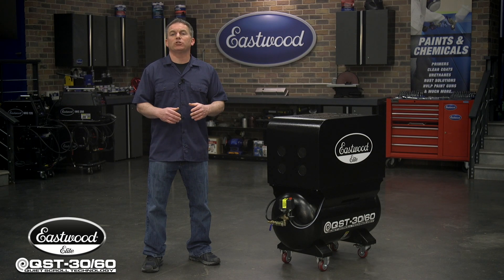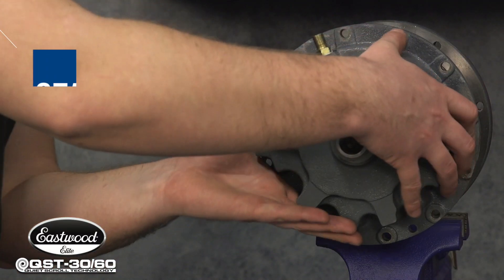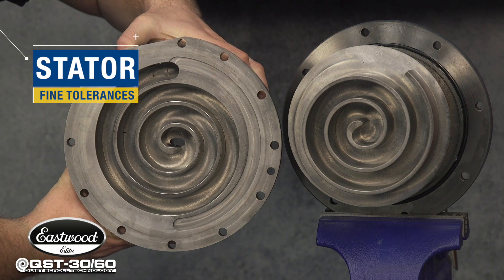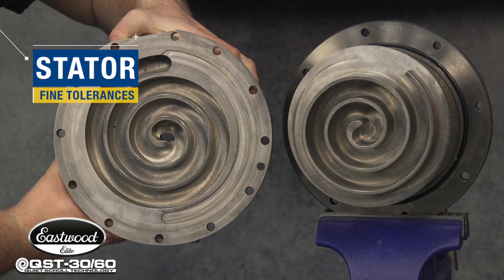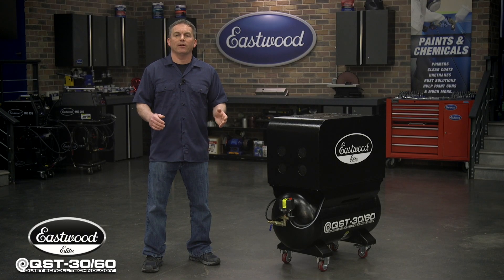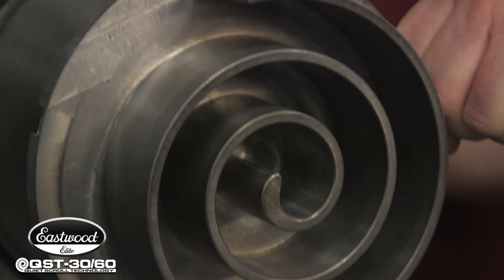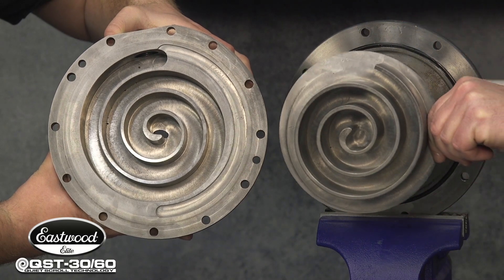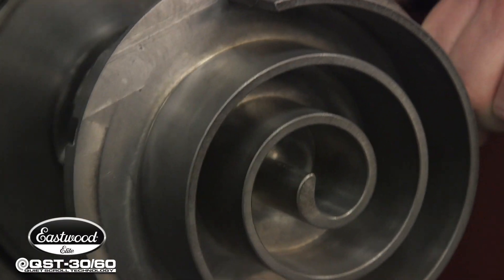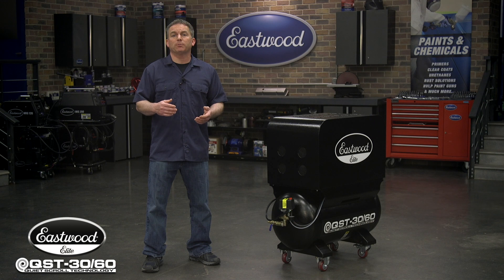The reason a scroll is so quiet is because it has so few moving parts compared to an old piston-style compressor. With the stator removed, you can see the inside. These two pieces we just separated never actually touch — there's a small tolerance of a couple thousandths between the two, and a premium synthetic oil creates an airtight seal. When the crankshaft is turned, it moves in an elliptical pattern. The rotating section turns inside the stator, pulling air in and compressing it as it goes around to the center and then out. This makes the scroll 100% efficient because it's moving in one direction constantly, as opposed to a typical piston compressor where it only makes power on every other stroke, which is far less efficient and very loud.